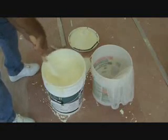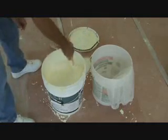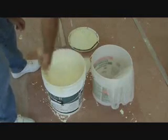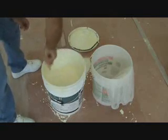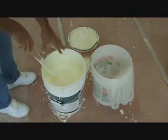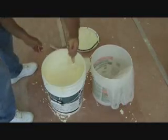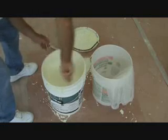Don't think you're just going to mix a little bit of the top because you're only going to use that — it may not blend into your wall. That's another good reason why you should strain your paint. Sometimes I haven't strained brand new paint, but I test it, and if I see any globs in it I'll just strain it. Get in the habit of just going ahead and straining your paint.